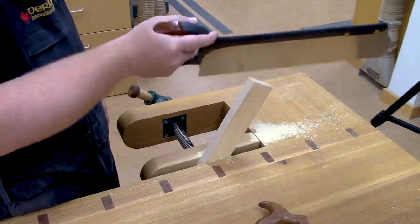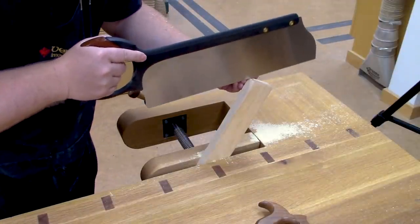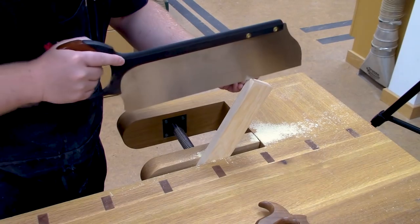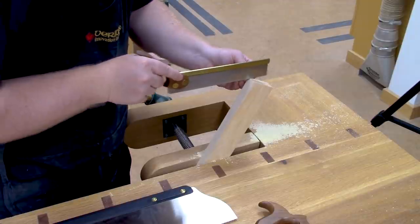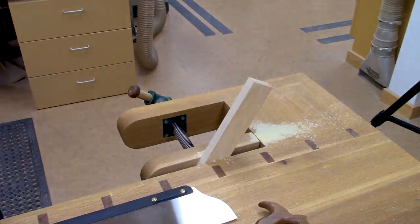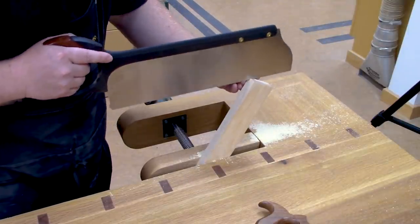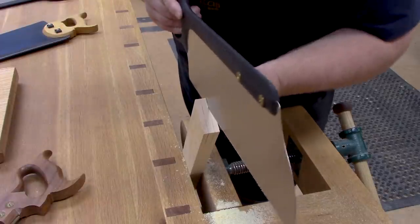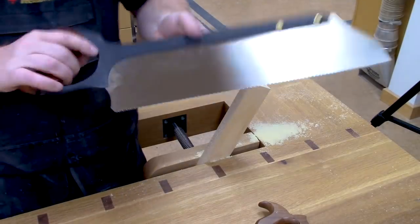It's easier, I think, by feel and sight — you can look at the saw and go, 'oh, I'm not cutting straight.' Also with the longer blade it's a little bit easier on your body to make repetitive cuts over and over. If you tried to cut with a little dovetail saw, you only get eight or nine inches of teeth working, so it's a lot of short little strokes. With a longer saw you get longer strokes, it cuts faster, and then you can get on to the next step.